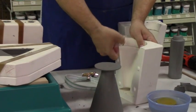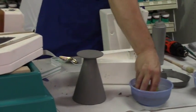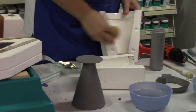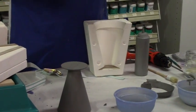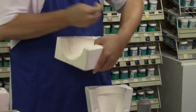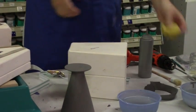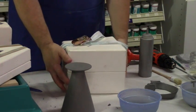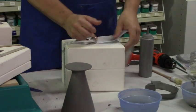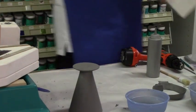Now, to the mold itself — you have to put the mold back together. This is part of the care of a mold. What I like to do is clean it up just like I was getting ready to cast it, because the mold absorbs water out of the slip. The more slip you leave on a mold, the more it keeps absorbing and wears out quicker. So basically, if you take care of your molds, they'll take care of you and you'll get good quality wear out of them. Good quality greenware means good quality finished pieces.